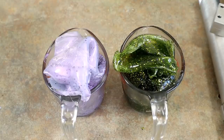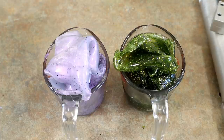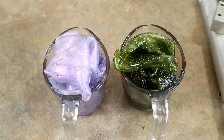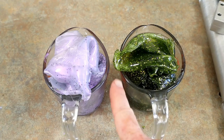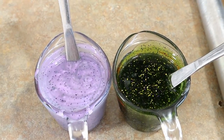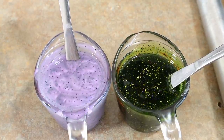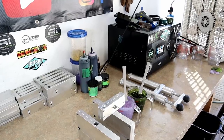I emptied the contents from the two larger cups back into the sprue cups — now these become the cups we operate out of. I'll remelt those down, probably take two or three minutes, and then we'll have more plastic ready for more molds. Just like that, we have more plastic ready to roll. We're going to run some more bugs and basically just see how much we can get. Punch bug round two.